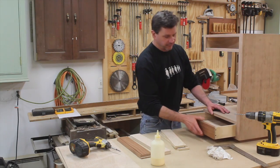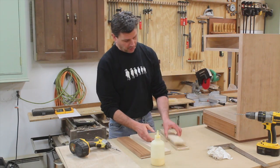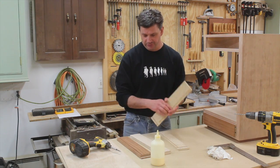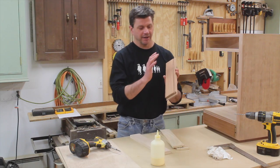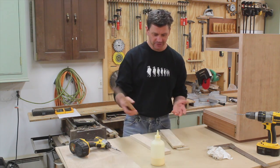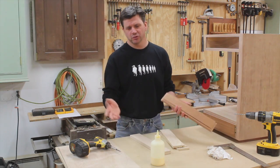It's a new day and I finished making one of the drawers yesterday. I forgot to mention — when you're cutting the grooves in your drawer sides for the bottoms, cut the groove at the same time in your drawer front. Not only did I forget to mention it, I forgot to do it, so I had to go back to the saw and reset it up. Luckily I was only working with two drawers, so it didn't waste that much time.